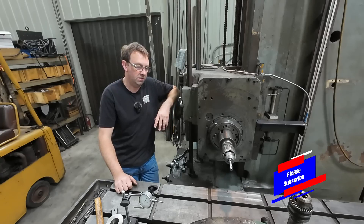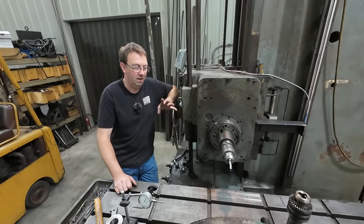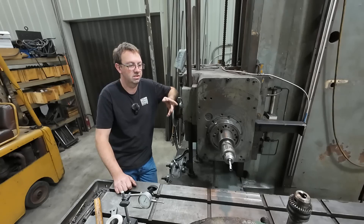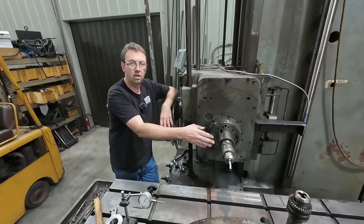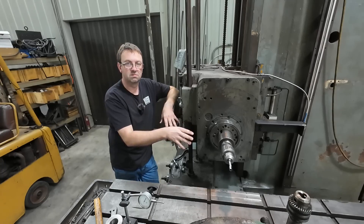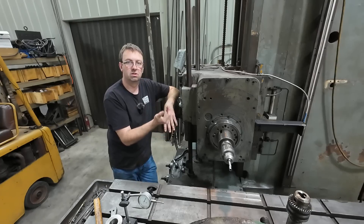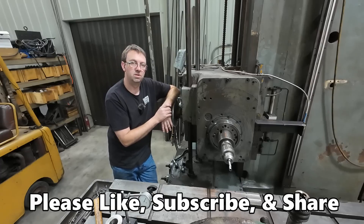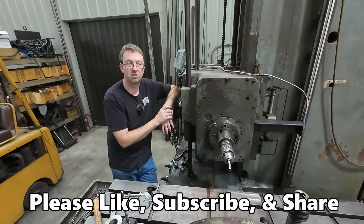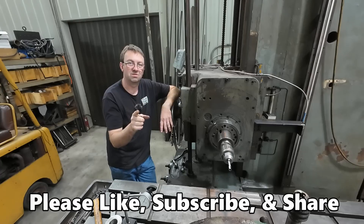So it appears I've got some chucks to go through and some tooling to look at. I'm going to go through a few things before I get to my steam engine cylinder boring, which I'm hoping will be next week's video. I apologize for not getting any machining done today, but this is something very important to know about your equipment. You can do it on a vertical spindle, even in a horizontal mill. You can test anything in a spindle and make sure it's running true — because a chuck running out will actually oversize a hole, and you could wind up screwing up a part if you need to ream it to size. I hope this was educational and informational. If you've noticed anything funny, grab an indicator and check it — it doesn't take long. Until next time, get out in your shop and get it done right the first time.